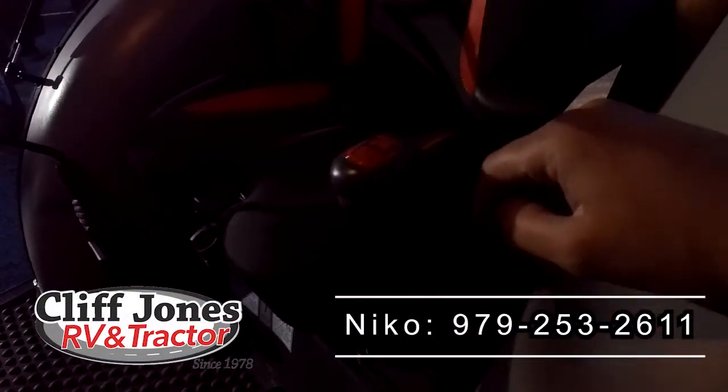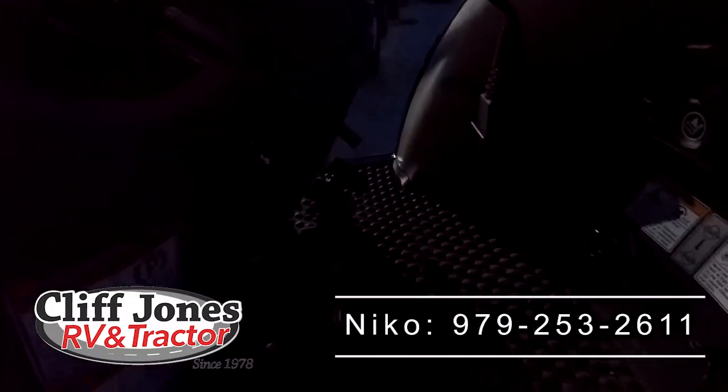This tractor has the in-comfort seat — brand new seat design, very comfortable, has armrests. You also have a cup holder and a place to put your belongings so you don't drop your valuables out in the middle of a pasture somewhere. This is a hydrostatic transmission, so you have low, medium, high right here. Here is the brake — you can unlock that and make a tire turn to the left or right. This is the locking rear differential, which locks all your wheels together if you ever get stuck. It also has tilt steering so people of different heights can easily use the tractor, and a weight-adjustable seat so you're not bouncing around as much. This is what I was talking about on the fine adjustment right here — you just press this and slide it in and out really easily. It also has a toolbox on the back, so that's nice if you want to carry stuff with you.